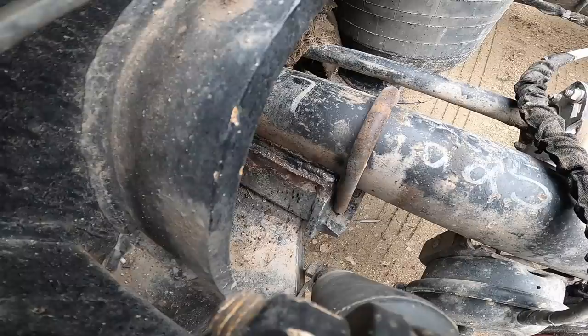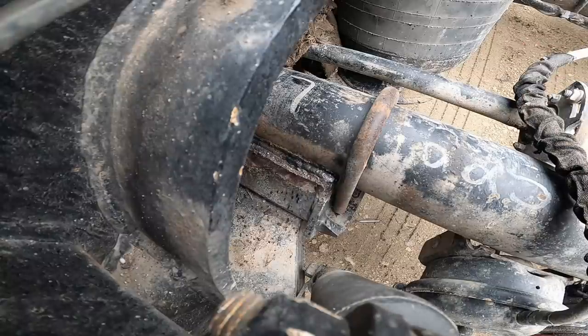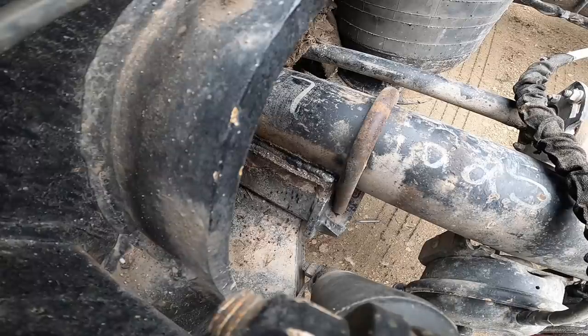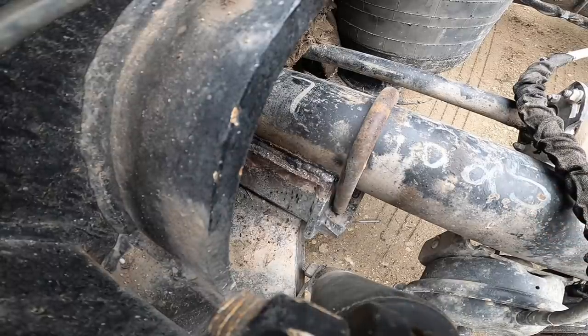I don't know if it was visible in all the brightness that was going on, but there were a lot of BBs being shed off. What happens when that happens, normally either you have some magnetism or the amperage could be too high. In my case, I felt the amperage was a little high, so I'm going to make the adjustment and switch over to 5/32s.